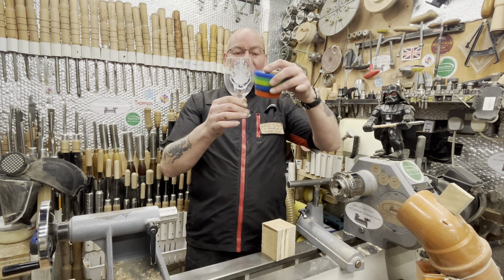I like these mechanisms — they don't have any silly little screw things. They're ceramic, it's a clip fit. You make your hole, put a little recess inside so when you push it in it clicks and locks. This pushes through into your lid — again a little recess — and that pushes and clicks in. The lid is a push fit. You cut the bar down to whatever size you want. I watched Mike Mahoney doing one on a pepper mill — much like me, he doesn't like doing pepper mills, finds them boring. He does them in a bud vase type shape, which I really like. So it's going to be a bud vase type shape pepper mill.